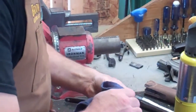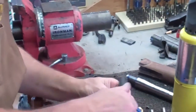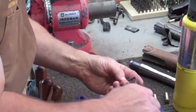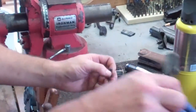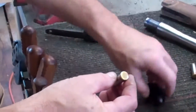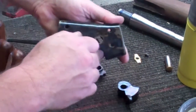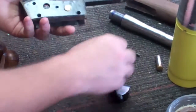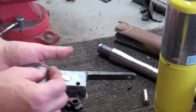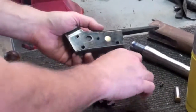I bet that's going to be getting hard now. Alright, there's your screw right there. Now what I'm going to do is polish the head back up just a little bit and just the tail of it. Because in this particular gun project, the pins that go through the block and through the hammer are actually gold plated. And the little butterfly retainer that holds both pins in — it's gold plated. So these screws that I make for this Remington rolling block, it's all going to be gold plated.